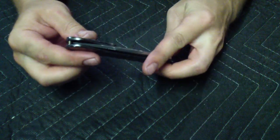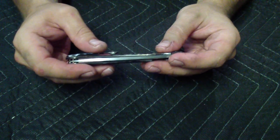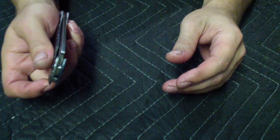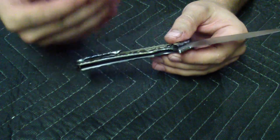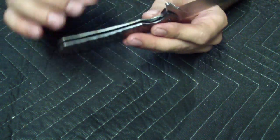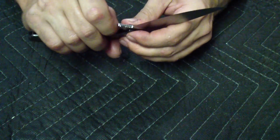I just heat treated it, kinda, you know, just heated it up and then cooled it down real quick, but in the air, not a water quench. It's an ABL insert. It looks like it's holding out good. It looks like it's not too soft and doesn't feel like it's too hard. It shouldn't be fragile. So we'll see. No stickiness at all, even with the really strong lug, and it really jams that lug into place. Doesn't stick, obviously, it's steel on steel, so it's not gonna stick. But it's also because of the way I nailed the lock angles just right, rock solid, it's not going anywhere, so that's pretty good.